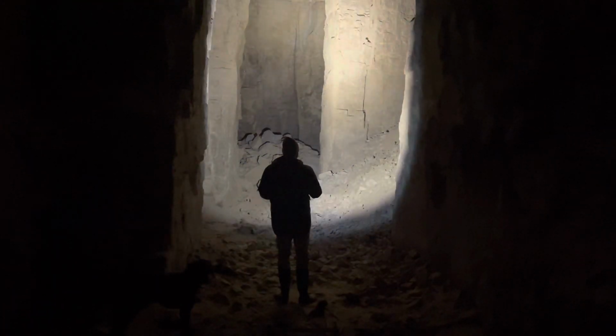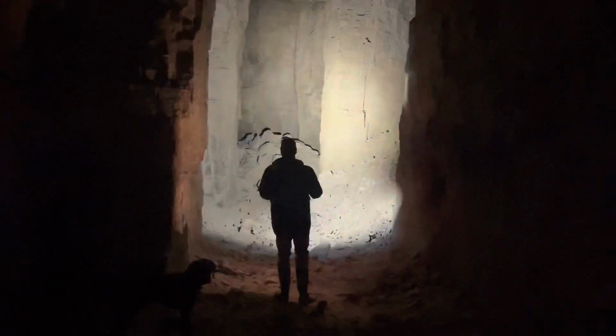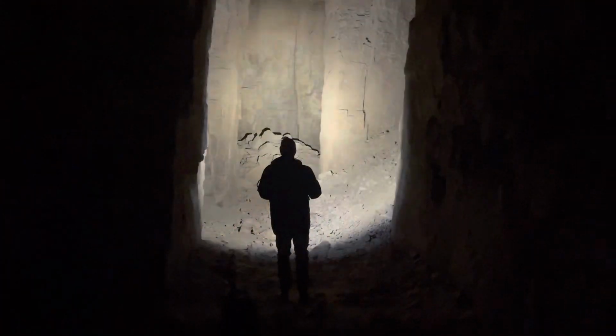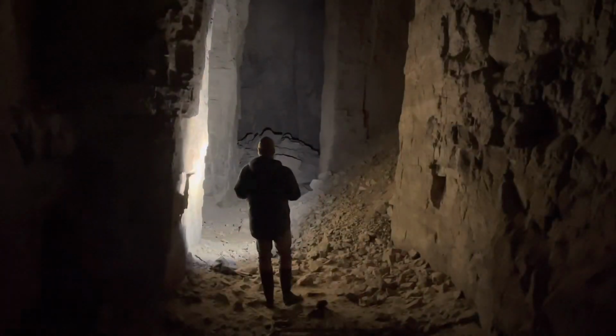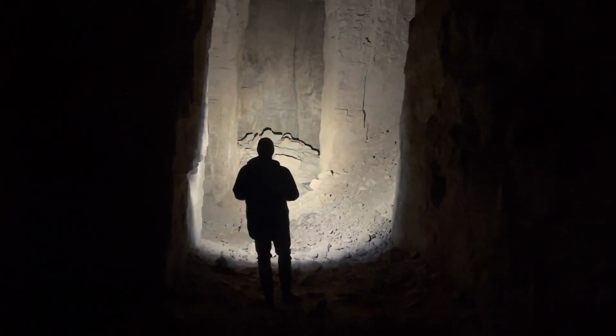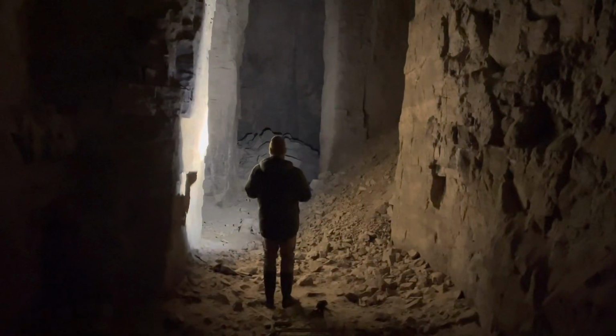I will now show you the second highest mode, as they call it, the T2, with 800 lumen. Here I measured 740 lumen. In this mode, the light will run for around 120 minutes, and then it will dim down to 230 lumen and will continue for 1 hour. Here I also measured 200 lumen. So we'll turn off the light, keep the button pressed for a long time so that we activate the lowest mode. As you can see, the lowest mode is indicated with 1 lumen. I measured 0.6. Then we have the 4 lumen mode, which I measured with 2 lumen.